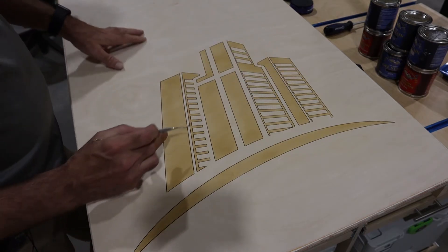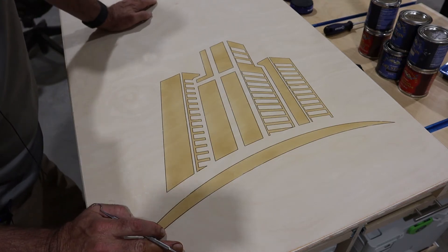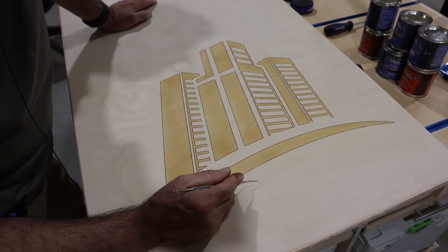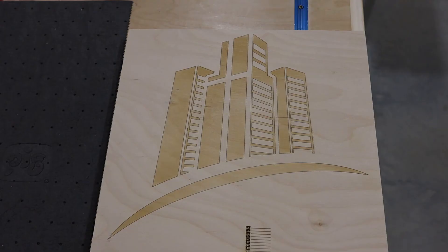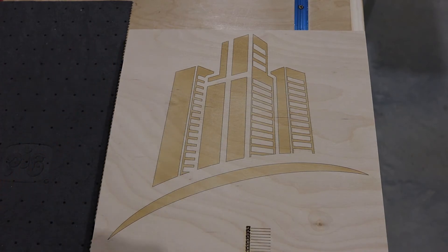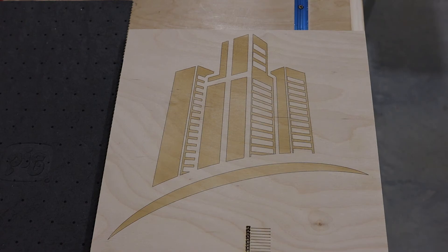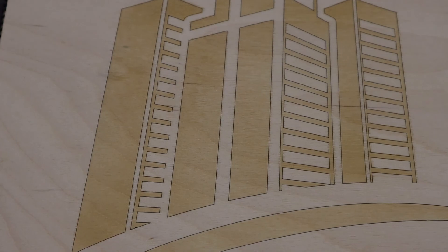So you can see there's almost a line that runs through where the tape was overlapping — not perfect. This one's got just a little bit more bleed, which I expected because of the deeper burn, but all in all not a total failure. It'll work. This is my test piece and you can see there's just almost no bleed whatsoever. I credit part of that to the fact that when the laser cuts the mask it's also severing the wood fibers right there on top, keeping it from wicking in there. It also gives this really nice black hairline outline to the whole thing. That's all done with alcohol dye and Transtint. Thanks for watching.